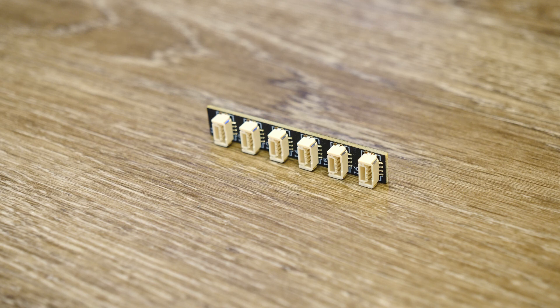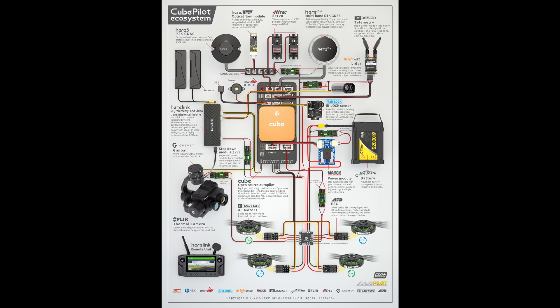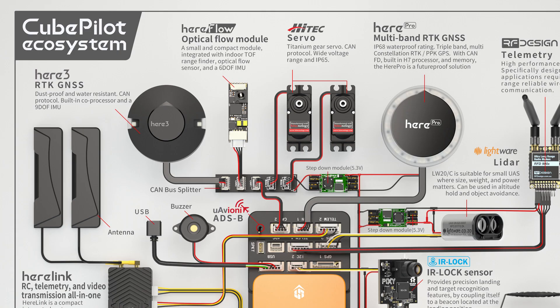It uses the same four-pin connector. Something to note is that if you are using multiple CAN devices you may need to add an external CAN power source because the autopilot may not have enough power to supply them. CubePilot have released both a puzzle and a poster showing this, giving an overview of using the I2C splitter board - now called the CAN splitter board - and having an external BEC attached to power additional CAN devices. So if you're using lots of CAN devices, make sure you have that external power.